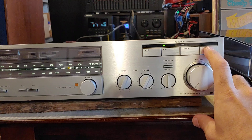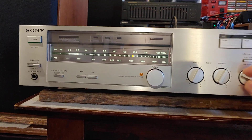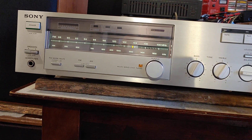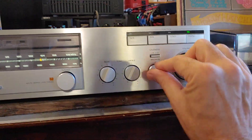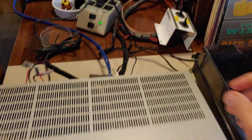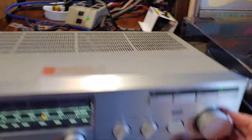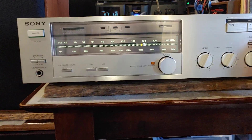I'm going to change it to a PHONO input. Now I've got to drop this arm on this guy. I've got a problem with this connection back here — I need to clean that some more. I cleaned up all the terminals and such. PHONO being such a low input, it has more effect. You can hear that. That's something to look at if you ever have a problem with that. PHONO is such a low, low voltage input, but just any corrosion at all can really mess up your PHONO in.